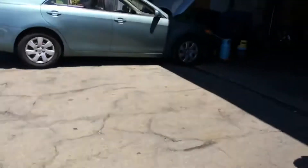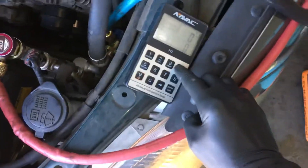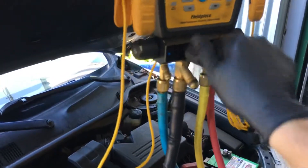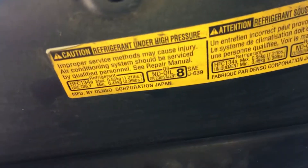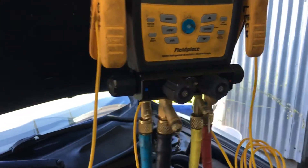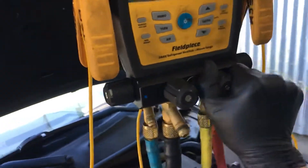Alright, let's fill this up. We're ready — let's zero this out. Always check that your scale is working. Scale is working. Low side is off vacuum. We are at 500 — let me focus — I need 550 grams. Okay, vacuum is off.